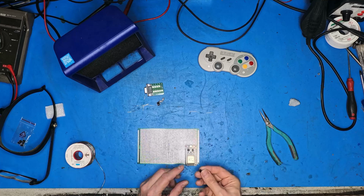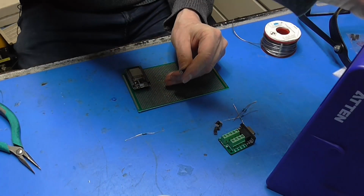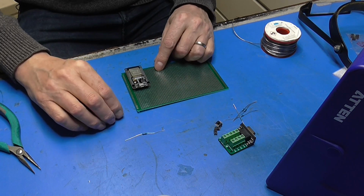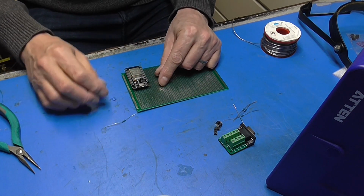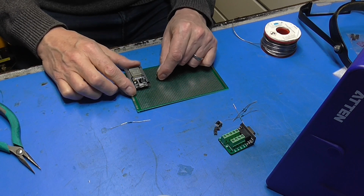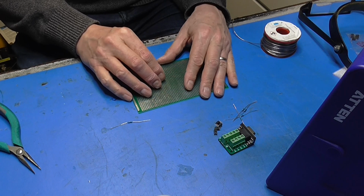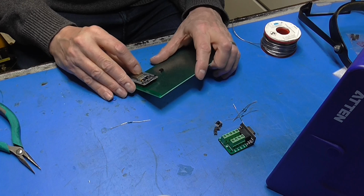So now we need to position our five optocouplers. Switch that off. Five optocouplers down this side, and we're going to have to get our 100 ohm resistors in between. Of course, if we made this on a PCB, we'd probably be using surface mounted resistors. That I could do on the back of here. You can get 0805 quite nicely between the two pins, but there's no point in doing that at the moment. Let's see if we can get a working prototype put together.